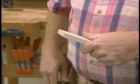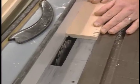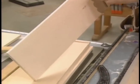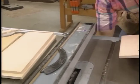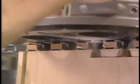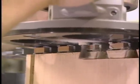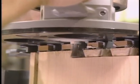That's just right. Now I've narrowed my dado head cutter down to 1/4 inch in width, and readjusted the fence so that I can cut a groove down the side of each side piece and front piece to receive the plywood bottom. Now, using my dovetailing jig and my router, which is set up with a dovetailing bit and a guide collar, I'm able to make the tails in all the side pieces.